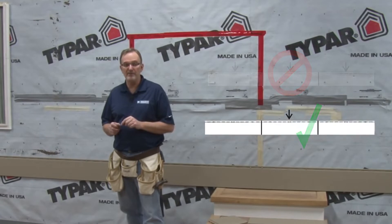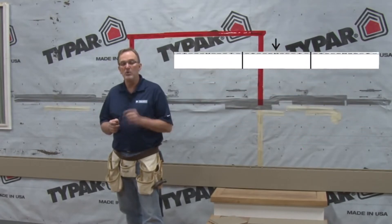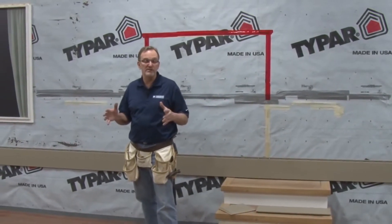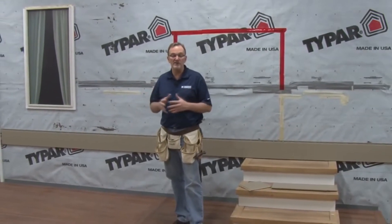The reason for that is we're going to manage the expansion and contraction of the panels. We're going to make it so that half that expansion and contraction goes to the left of that pin and half goes to the right. That way, when the panels are at their shortest, the ends of the panel are still hidden in the pockets of all the accessories. Let me show you what I mean.